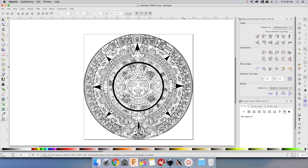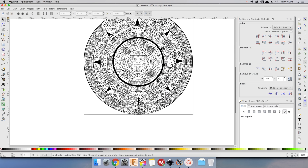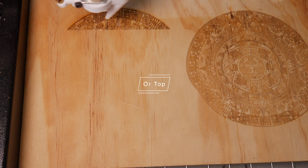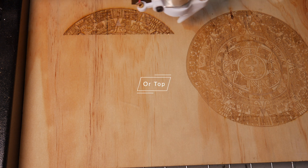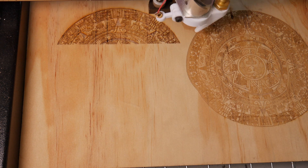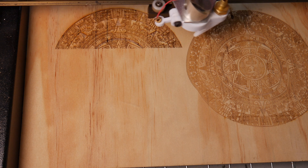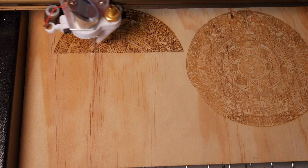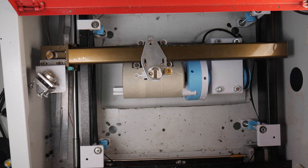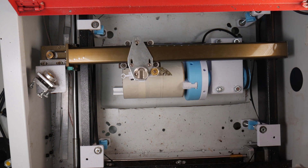Visualize it this way. When you're facing the laser, if this is the image to be engraved, the laser head will move in the X direction — left to right — starting at the bottom of the image. As it gets further along, it will also move in the Y axis, or downward, to complete the engraving. Now imagine if instead of moving down, it rotated. That is what happens when you remove the connections for the Y stepper and connect your rotary stepper motor.